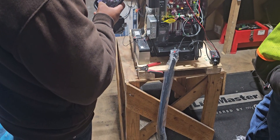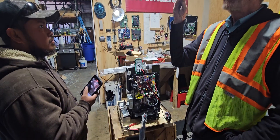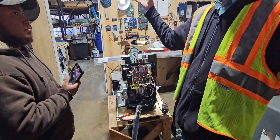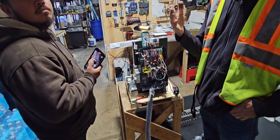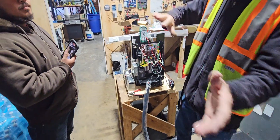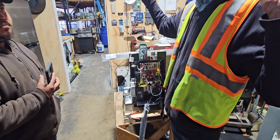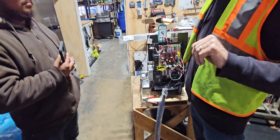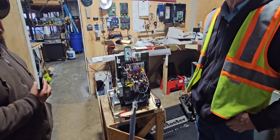It sounds like we should start doing some solar because we don't have to run the conduit. Solar would be a lot easier — we don't have to worry about that. Solar panel has to face south at a 45-degree angle, not in shaded light. If you're under a tree but have sunlight, that's not direct sunlight — it doesn't charge properly, you're going to have charging problems. I can move a solar panel up to 100 feet away from my gate operator and still not have a problem, because adding 100 feet of wire is not going to stop the output. I can go down the driveway, on top of the roof — anywhere I need to get that sunlight — and just run that wire.